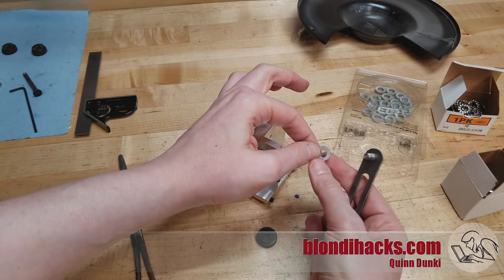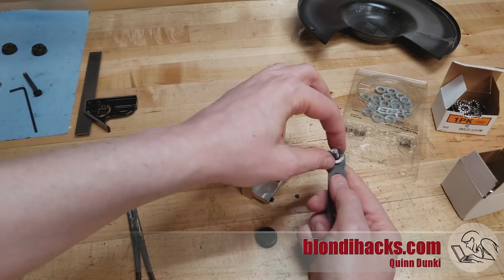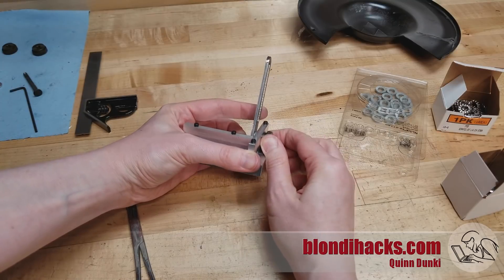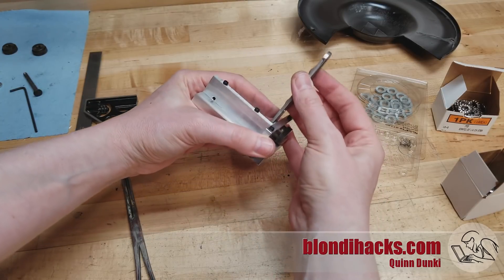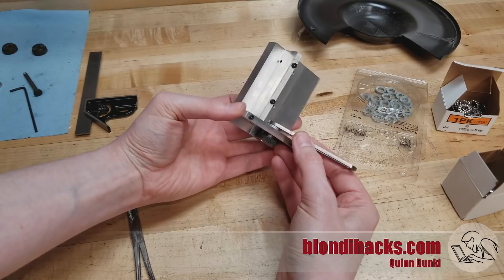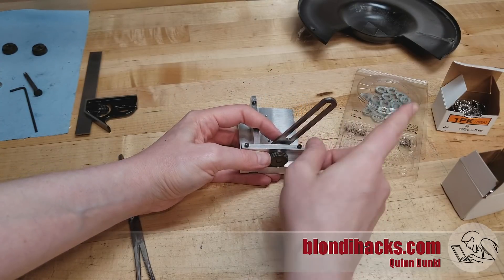Let's try the Cadillacs. Here's our Nord-Lock — the lock washer for the one percent. I'm using a pair that's still glued together from the package. If they're not glued together you've got to make sure the dog clutch faces are matching and the small serrated faces are outwards. So yeah, that's not great honestly. The right fastener for the right application — I think this is not the right application for Nord-Lock. This is not a criticism of them; it's just that with only finger torque being applied to the fastener, that's just not going to lock. I need something that bites at a much lower torque. So the serrated washers are the winner.